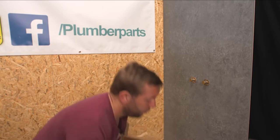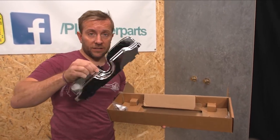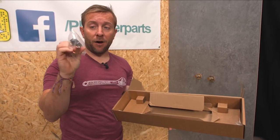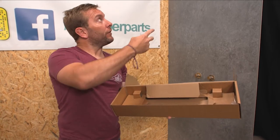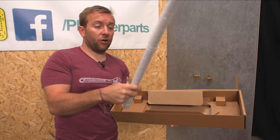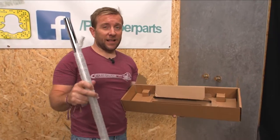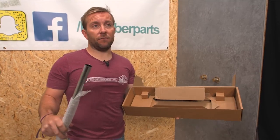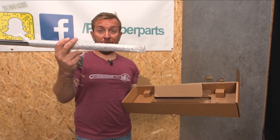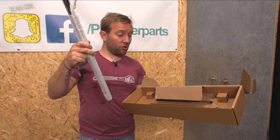This is all about covering these up and giving us a nice point at which to install the Quartz controller. I'm just going to pop that down here on the floor. We've got our underside of the shelf — all chromed, going to look beautiful when it's installed. After that we've got a straight coupling installed for 15mm pipe and also an extension piece. So if we've got a higher ceiling we can put an extendable piece in — this is just the chrome outer piece. If you're working in older properties that tend to have higher ceilings, you've got an extra couple of feet here that's going to be able to get up into that ceiling.